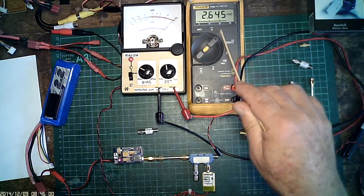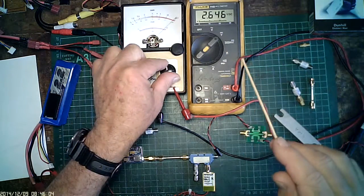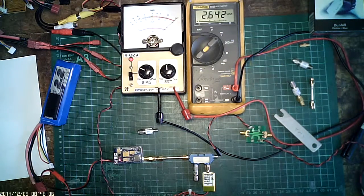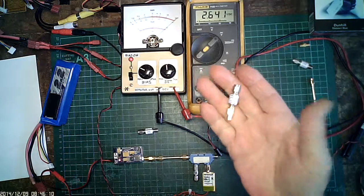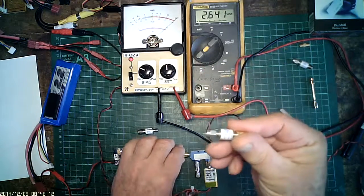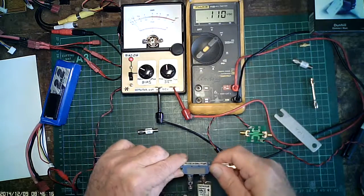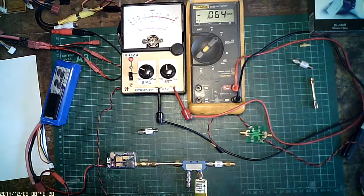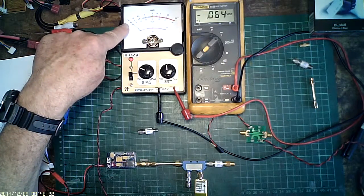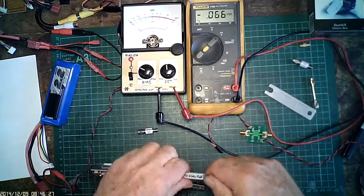It started off at about 3.4V, so I think the diode's a little bit stressed. And we'll do the dirty trick — the IB crazy dirty trick, a very valid test. This is a termination. We're now getting VSWR 1 and the reflected voltage is now 0. So that worked just fine.